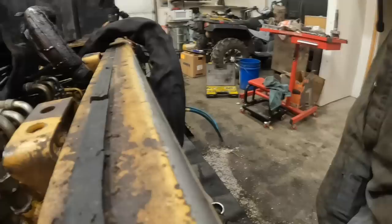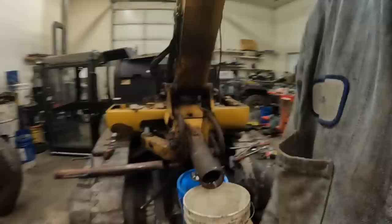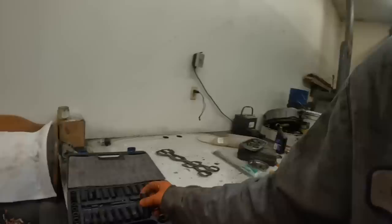And so finally, I came to the conclusion after I pulled the fill cap off, where you pour the engine oil in, and was cranking on it a little bit. It was blowing more smoke out the fill plug than it was out of the smokestack. So, I have a low compression situation going on there, basically. Not enough compression to make it start. So, I called those guys and told them that it needs an engine rebuild.